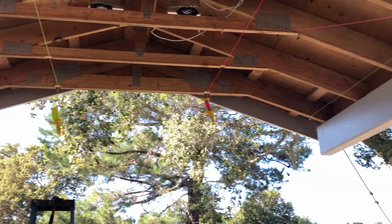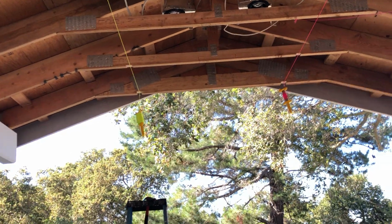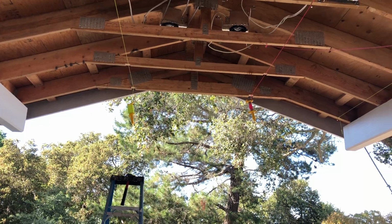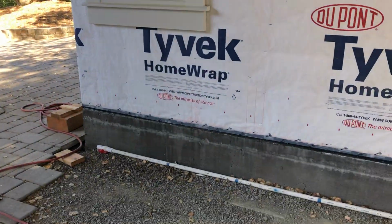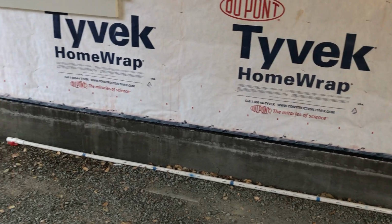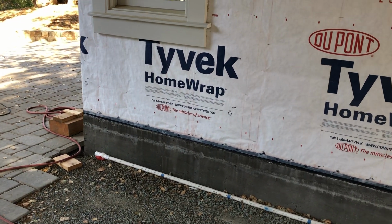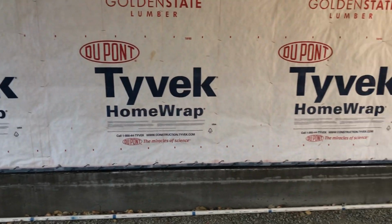Well, then that one doesn't need to be cut. So if I cut these two pieces of wood, then hopefully tomorrow morning I can actually get my corners in place. And then I've got a little other prep work to do. I've got a little bottom border that has to get put in and caulked in so that the first piece of siding has a little bit of a kick in it, just like the rest of the pieces of siding. And then I can actually get started.